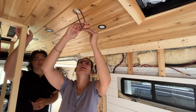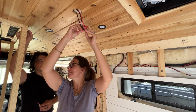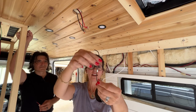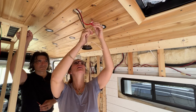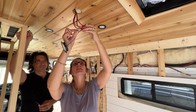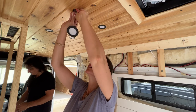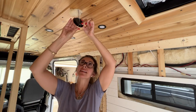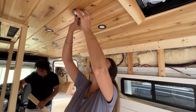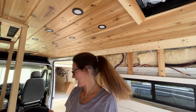These lever nuts are way better - so much easier, especially for ladies with fingernails. Again on ours the label says black positive, so it goes with the red. The negative is the white wire - snap, good. Then push it up in there and again it has clips so they go in reverse. Shove it in there and voila - now we have lights. Let's test it.